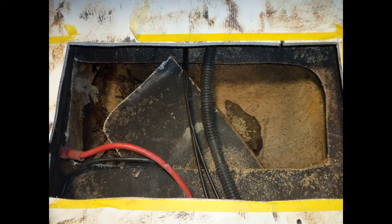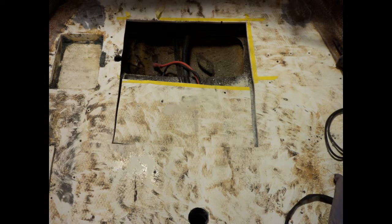We've actually done an exploratory hole through that subfloor, which is thin plywood with some resin over it. Below that should have been a fully filled flotation foam cavity, but the flotation foam never was at full capacity and is an inch or two below the ceiling of that box. We're going to find a lack of flotation foam. Because we've got a bigger area that needs to be addressed, we're going to enlarge the surface floor cut opening so we can get better access to what needs to be done below the floor.